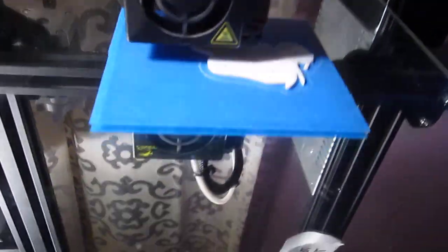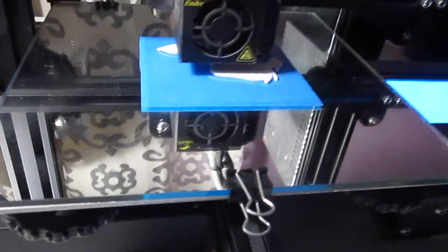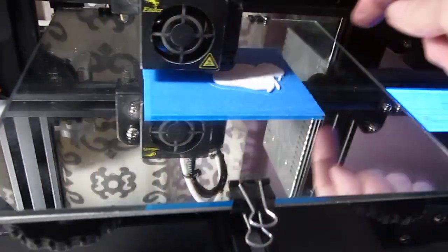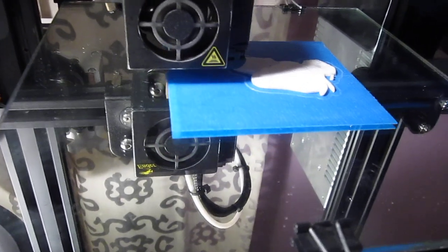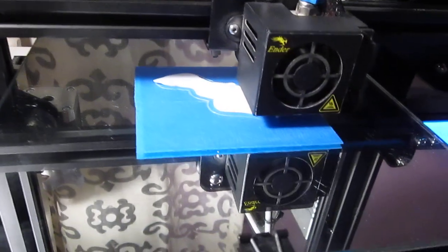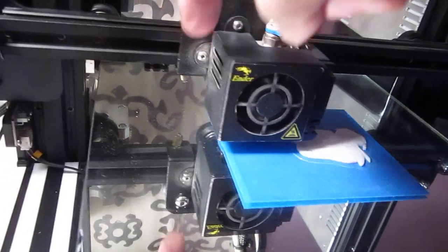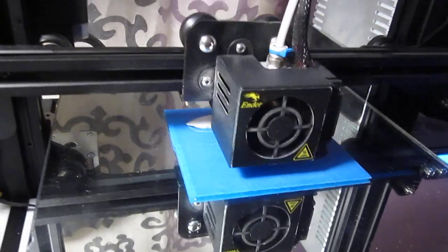As you can see here, in all my prints, I am using a very flat mirror tile — known to be flat from the factory. The reason I use it is because it is flat all the way across, all the way back, all the way from side to side. When you do that, the printer problems of flatness have already been solved. You don't need an electronic gizmo attached, having to deal with it all the time. You just don't need it.